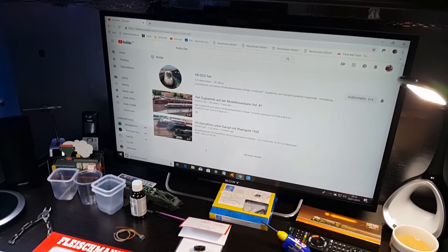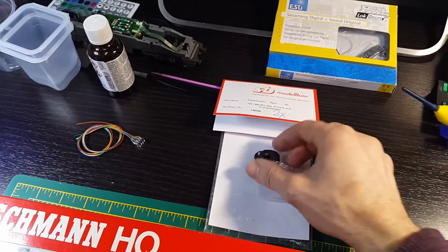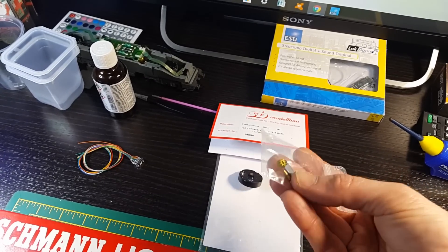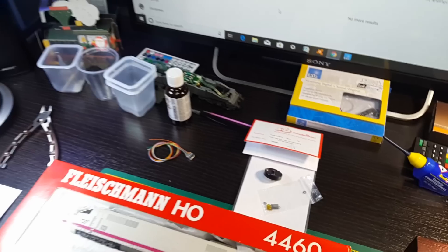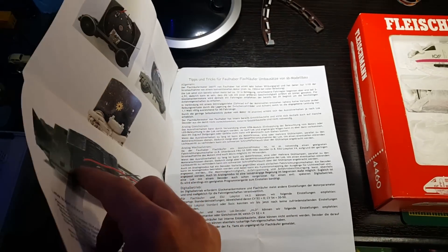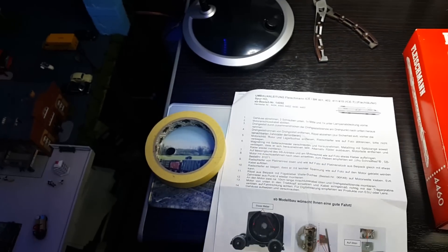The way he's explained it to me is great, because the instructions with the motor when you buy it are all in German and they're not the best. It's a coreless maintenance-free motor. You've got to take all the old motor out and the pinion gear, reinstall it - there's a new pinion gear and a little sleeve for the shaft. It's quite an involved process and there are no videos on YouTube showing you how to do it.